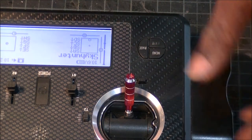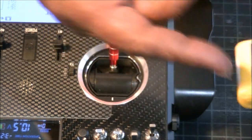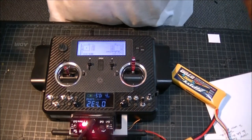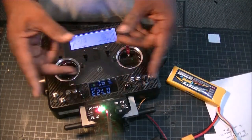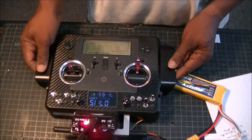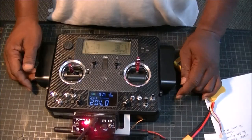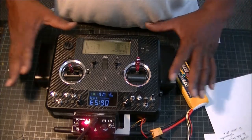So now I'm actually ready to go. I'm going to use my battery — a light 2700 milliamp battery. I'm not sure where I got it from, but it seems to work for what I'm going to do. I don't have my receiver set up to it right now because I'm not ready for that yet, but as you can see I already have my green and red lights. This is all set up and ready to go, just waiting to be bound. In a quick nutshell: open your case up, attach the two wires, come back out through your auxiliary antenna hole, come up with some sort of mount for the top of the handle, put on an external battery, make your changes inside the radio, and you're ready to go from the radio side.